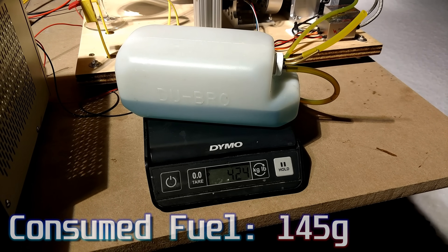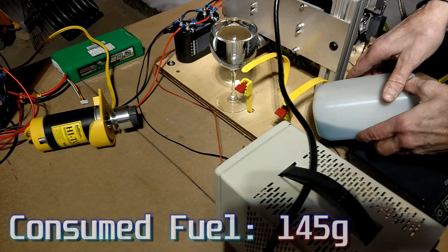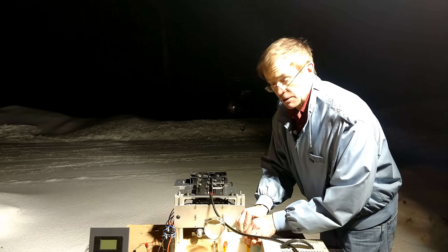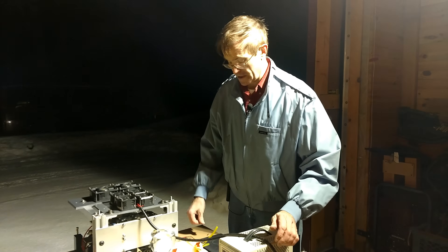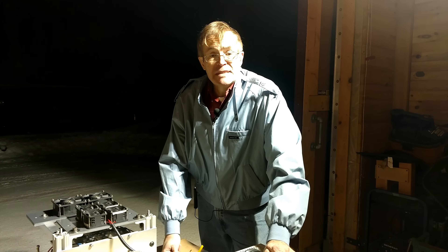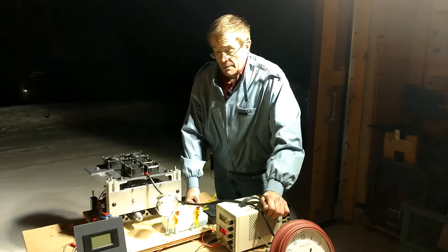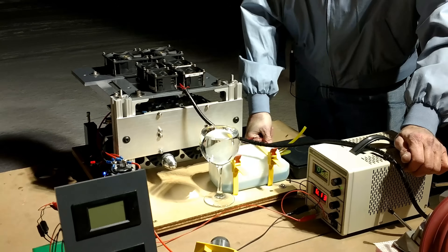So 423. You can do the calculations — that's a little fun back-of-the-envelope math. It turns out that fuel consumption numbers, as I've determined in the last couple of tests, are a little disappointing. I was originally hoping to get close to a 20 to 1 ratio of fuel versus batteries, and I'm actually seeing numbers closer to about 10 to 1. But obviously that's the compromise in going to the two-stroke engines. Still vastly better than batteries, and the light weight of the generator should still make this a much better option than loading yourself up with an enormous number of lithium polymer batteries.